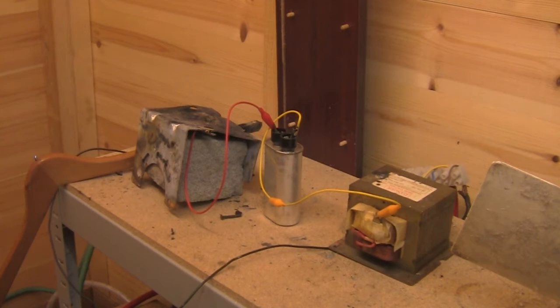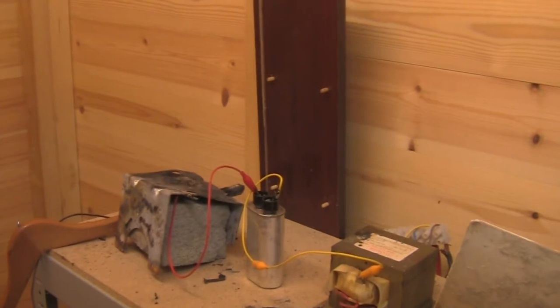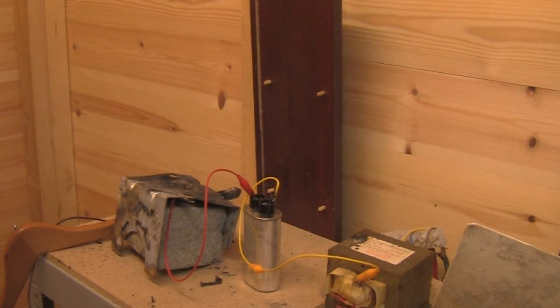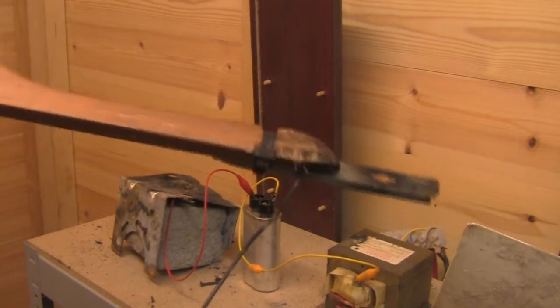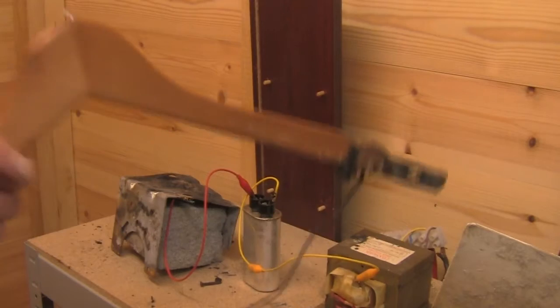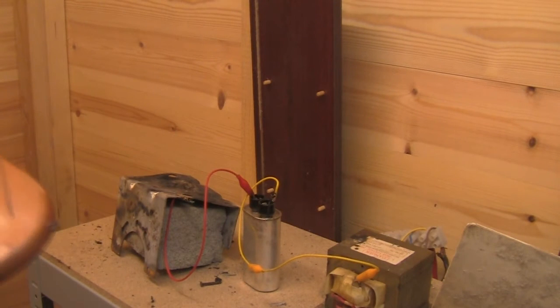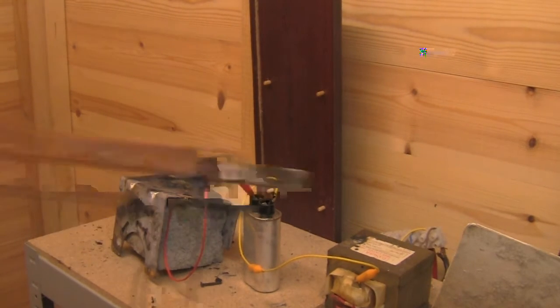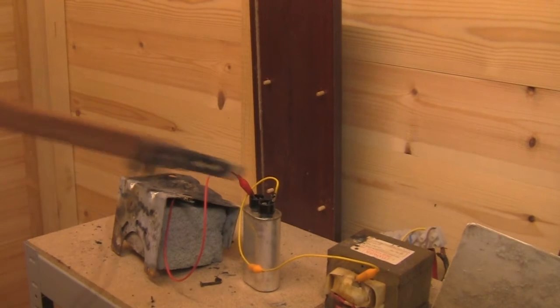Right, now in relation to clutter I have removed it. I have even bothered to remove the voltmeter because it is no longer needed. I think we will just draw some arcs, but really I do not recommend that you use wood - I personally prefer white or grey PVC pipe. When I was playing around with Tesla coils I noticed that black PVC tends to get a bit of carbon tracking. With neon sign transformers, obviously this is single phase and I have connected it to the ground on the transformer, and it is also grounded. Always ground these things because they are nasty.